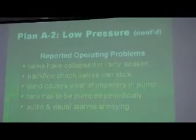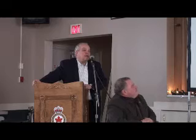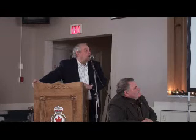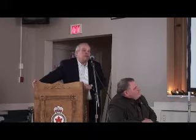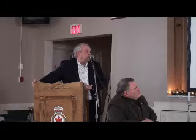Again, in talking with operating engineers in other municipalities that have these systems, they found that in some cases tanks have collapsed in the rainy season due to the hydrogeologic pressure. Backflow check valves can tend to stick, particularly if human hair is prevalent in the effluent. Sand also causes a problem because once it gets in, it wears the impellers in the grinder and in the pump.